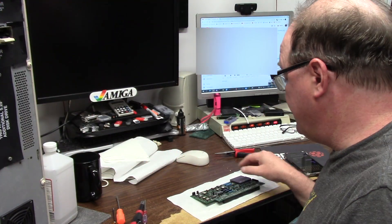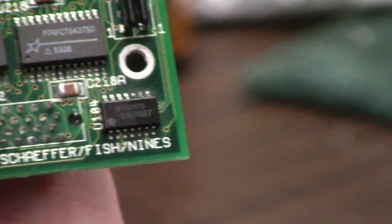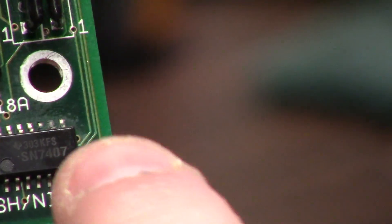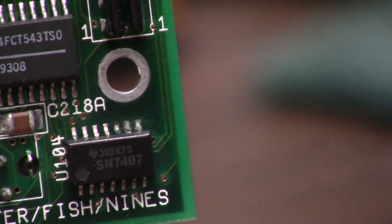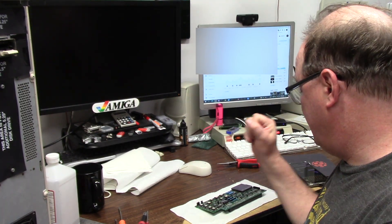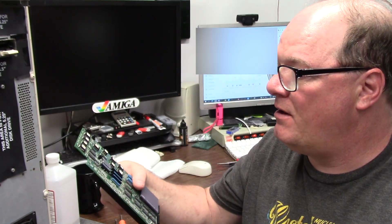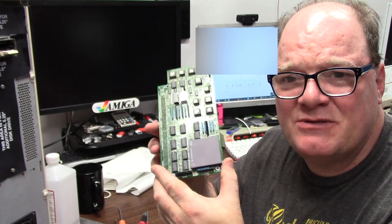But I got a 3640 here that is in need of some serious attention. All the caps are like gone. Right here, this chip at U104. If you can look at the top near the screw hole up here, you're gonna notice it's got some rot and several of the pins are totally gone. It is a 7407. I don't think I'm gonna hot air this one off. I'm just gonna go in there with the clippers and snip that sucker out — I don't know if it's like dry rotted or wet, but all the caps are gone and there's a lot of just stuff on the board. I can't really explain it.